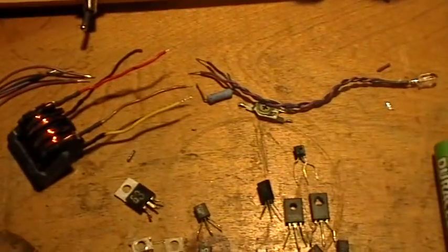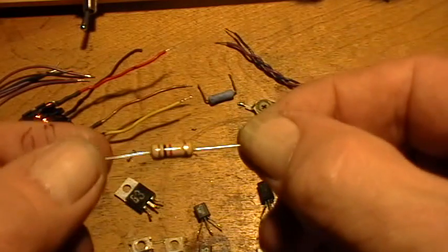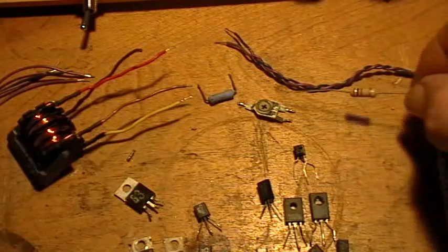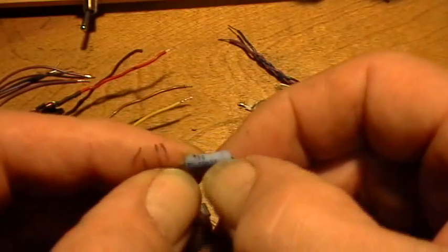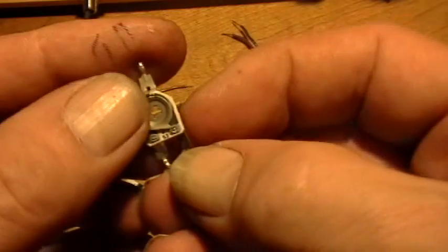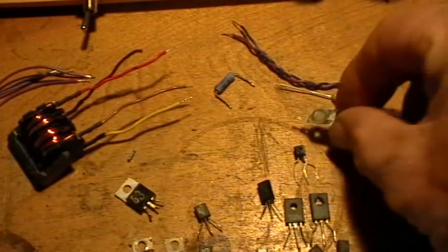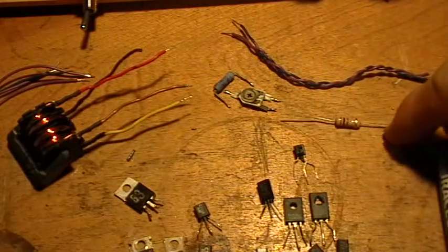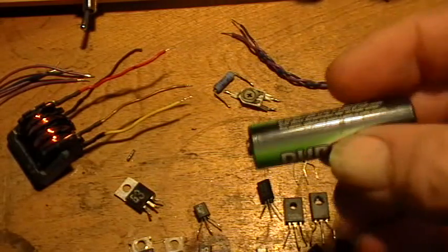Of course you need something that all free energy devices need, and that's a battery. You also need a little bit of resistance — sometimes you don't need it, sometimes you do. This is a 1k resistor, brown-black-red, and that's the only part you might need to buy. Or you can use one pulled from the television set — this is a 220 ohm power resistor. You might even be able to use a little trim pot; this one says 53 on it, which means 5k ohms, so you can adjust it to get your 1k once it's in the circuit. For simplicity I'm just going to use the store-bought 25-cent resistor. The battery is a rechargeable NiMH battery.